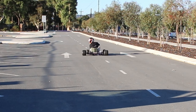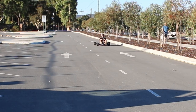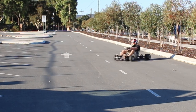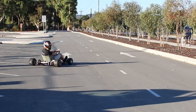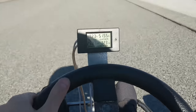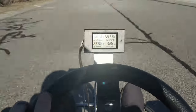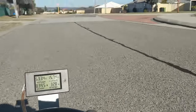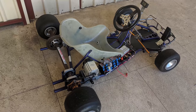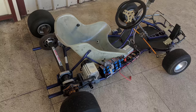I was also trying to monitor the setup while driving. The motor did heat up a little bit but was only warm to the touch. For range with mixed driving I'd say I could achieve around 25 minutes before the batteries fall too far below the threshold limit. The peak current I drew was about 55 amps. I was pretty pleased with the results and I did prove my concept, but to be honest I wasn't satisfied and I wanted to go bigger.